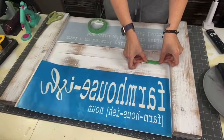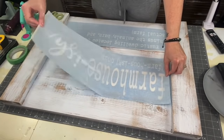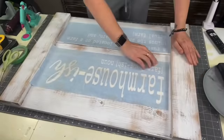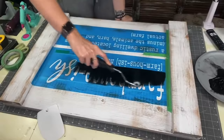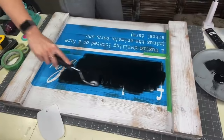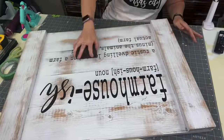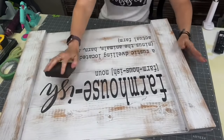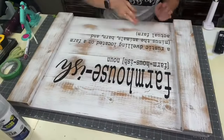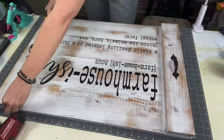All of this is in my Amazon store link if you want to check that out. Rub the stencils on and take the transfer tape off. Then I take Rich Black by FolkArt — this is chalk paint — and apply one coat with my mini roller. It is so jet black and beautiful. Once dry, weed everything out. Taking the rough sander again, go over it — if you want it more distressed just hit it with the sander. After that, I sprayed it with clear so the black doesn't smear, then coat it two times with Polyacrylic on the front and back.